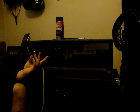I don't know how you check if they go out. I really don't, unless you look really closely and examine each one and see that they look different. But always keep them, just in case you do a gig and one of your tubes goes out, you can always replace it for a short time. The preamp tubes you can switch up and do whatever you want with, but the two power tubes, they synchronize them, they make sure they're leveled out, so you have to get those specific when you buy them in the kit. You actually have to buy two power tubes so they're matched together.